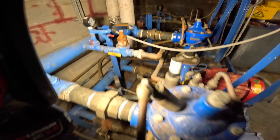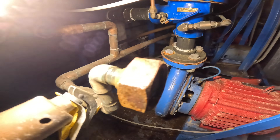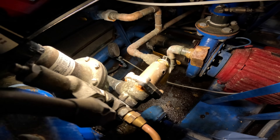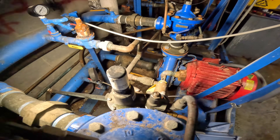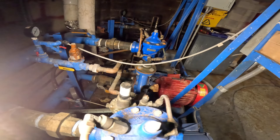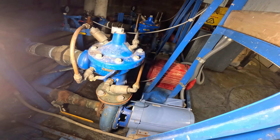We did it. This needs to be addressed. This should be capped off right here. And this relief valve has a little drip on it — it should be changed out. This place is just a disaster waiting to happen. Gonna make those recommendations, but this is what they wanted for now and this is all we're doing.